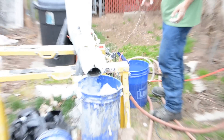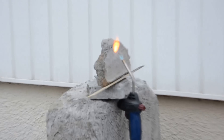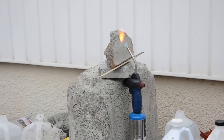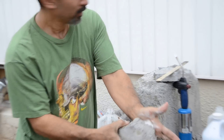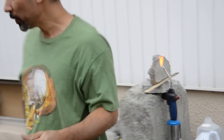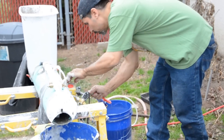My water flow rate has been set to one gallon a minute. Looking at the torch — the back side of the aircrete is cool to the touch. I'm touching it and it's cool. I wouldn't touch the hot side but you can see it's been on the whole time. Parameters: water flow rate one gallon a minute, 175 parts to one soap to water, 100 PSI air, Portland cement.